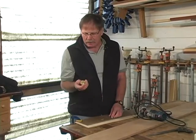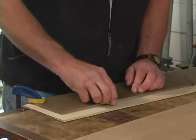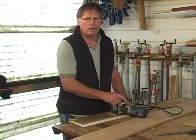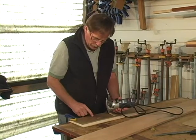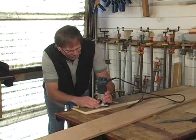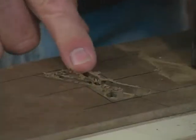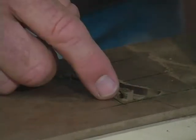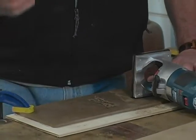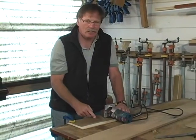I have a piece of masonite that is as thick as this bushing right here. When we use this bushing, we're going to be able to hit it flush and then cut into the wood that we want to put the inlay in. I've put my design on it with two holes so I can get the router to start cutting in here, and I'm just going to rough cut around this thing — not get too close. I'm going to finish the whole cut with my chisels. I'm going counterclockwise, cutting on the inside, sort of working against the router. I wanted the router blade to run alongside my cutting edge, so the blade runs alongside for a controlled cut.